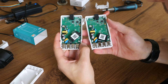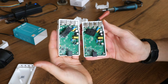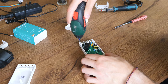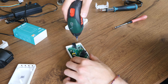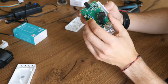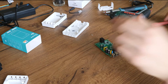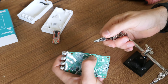You have the 20 amp version on the left and the 16 amp version on the right. Remove the four screws holding the PCB in place and put the screws somewhere where you won't lose them. Carefully lift the PCB out of the housing — attention, there is a Wi-Fi antenna cable going to the antenna which is fixed to the housing. Remove the antenna cable at the connection from the PCB. Locate the four DIP holes on the PCB labeled with 3V3, TX0, RX0, and GND. Put the pin header in place and secure it with a third hand in the middle.